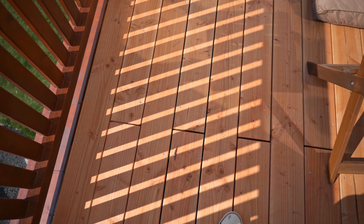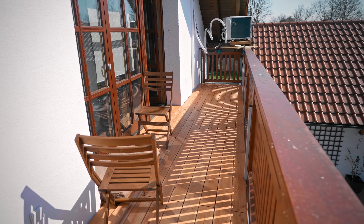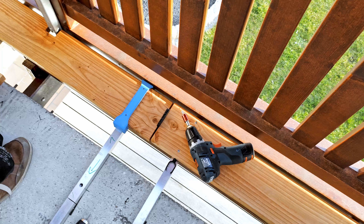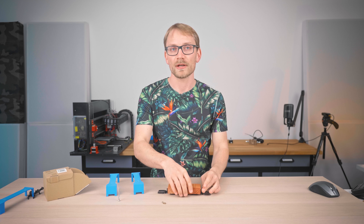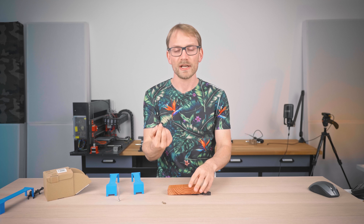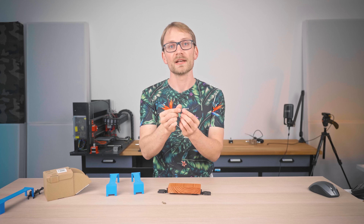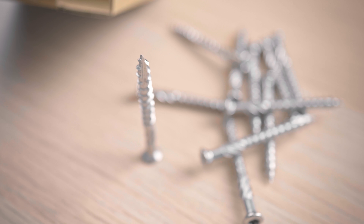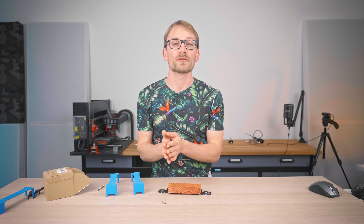With about three afternoons spent on the decking, it's all done. The screw holes all line up very nicely and I think this entire balcony turned out really well. There are still a few things left to clean up, like adding a baseboard. If you're interested, this deck is 26mm thick Douglas fir, sitting on 25mm square and 3mm thick aluminum tubing, which is much cheaper and adds less height on top of the concrete than those proprietary aluminum profiles you can buy. I'm using generic spacers between the aluminum and the wood, and it's all held down with 5x50 stainless tech screws with a T-drill cut tip.